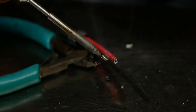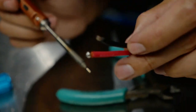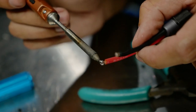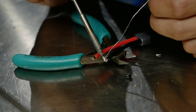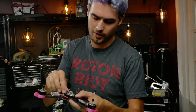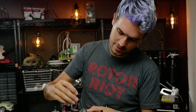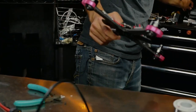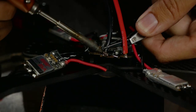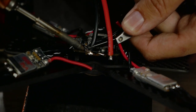Massage the wire with the tip to make it look good. If you've got a little solder bubble on one side, flip it so gravity helps and add heat from the other side to bring it through. The battery solder pads on our flight board have a semi-circle shape so you can sit the wire right in the crescent. I prop the quad up, hold the wire to the side of the crescent, and flow them together.